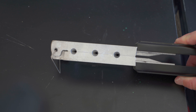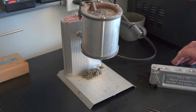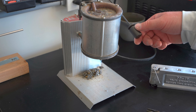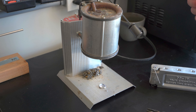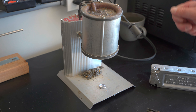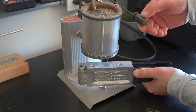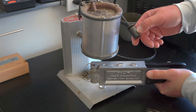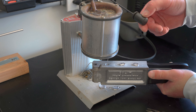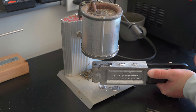Now everything's in there nicely — we just need to close up the mold. Once it's closed, make sure everything's nice and flush along the top; if it's not flush, you'll get flashing, which can ruin your jig. Before pouring, I like to check for good flow out of the pot. When you're using the Hot Pot 2, you don't have to worry about this because it just works like a ladle. We'll get our mold in the right spot and pour into all three cavities.